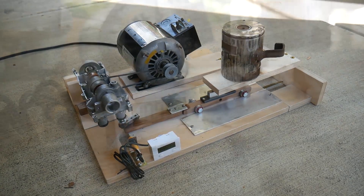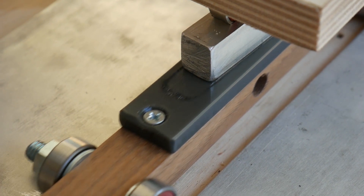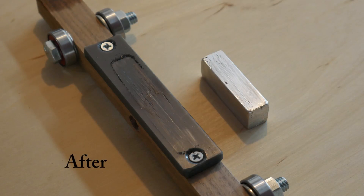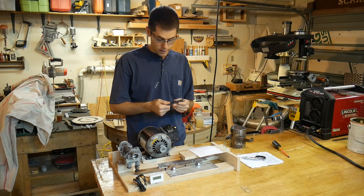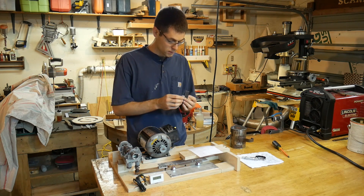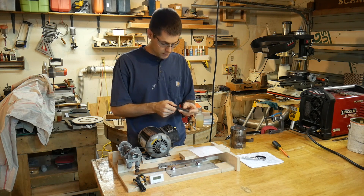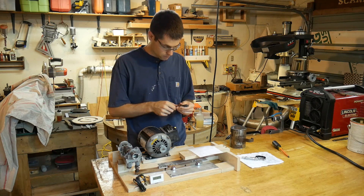The first one that I tested was the MDS Nylon. That one started off at 267.7 thousandths and ended at the same thing but 267.8 thousandths, so we'll just chalk that up to measurement error — it's pretty much exactly the same. It did cake up just a little bit of dirt on the surface, but it basically didn't change at all. It didn't really feel warm either after 10,771 cycles. The friction feels pretty much the same as on the backside. It did have a little bit of surface scoring, which is probably where the gunk came from, but really no difference.